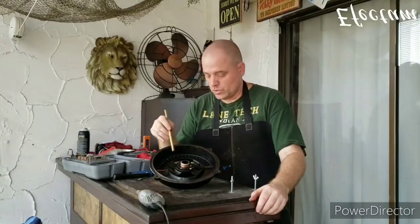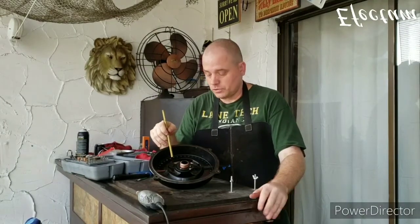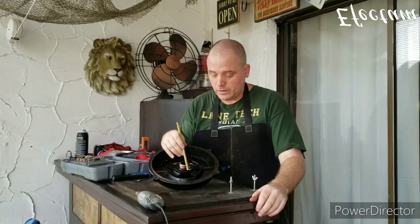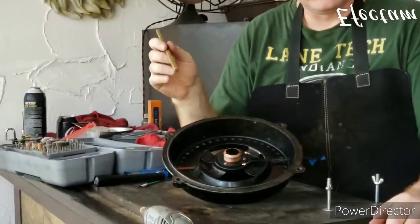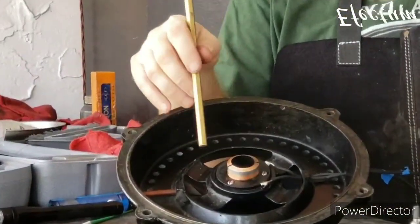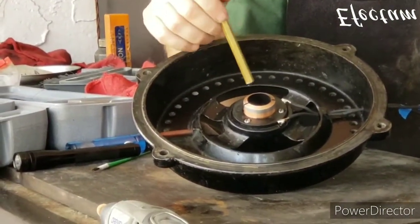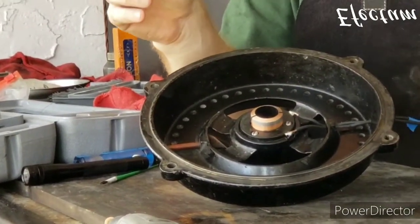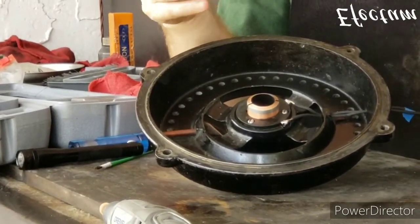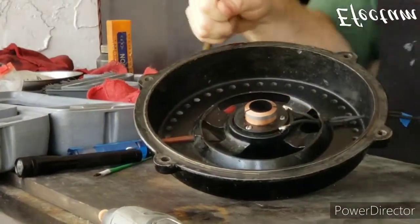Okay, so the end bell is rebuilt, and I feel confident that it's going to hold oil now the way that it should. We plugged the old holes, there were six holes total, and then I built up the edges here with JB Weld just for cosmetics, and now it looks exactly how it would have looked originally before somebody started grinding away on it. Then we cut a new gasket, we got a new gasket under here, and we have the switch mounted, and then I re-soldered the leads here and have those coming out the top so that we can get to the next step. We're going to bring in the camera here and we'll let you take a look at the finished job in this area.